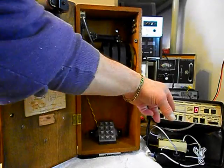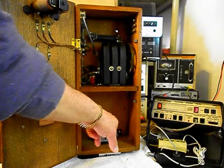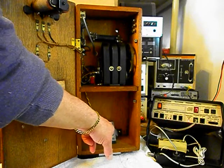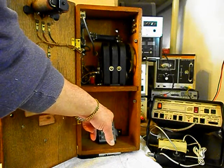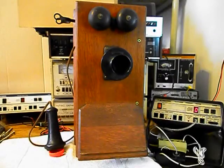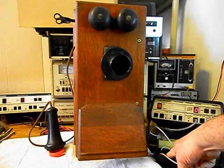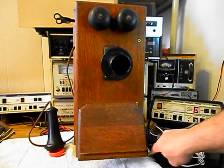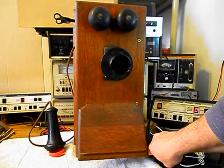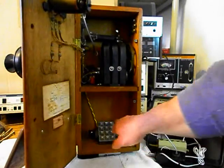Watch the analyzer and you'll watch the numbers roll by. I'm going to end in a two. Now what we can do is push the button on this switch box — that'll give us a line out and totally takes the analyzer out of the situation. We can call a time and temp number. So we'll go ahead and push that button — that gives us dial tone. We can open our unit and make that call.